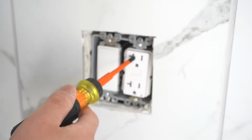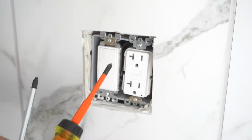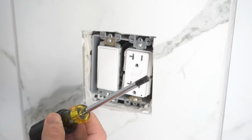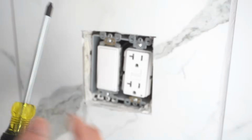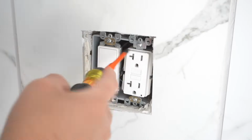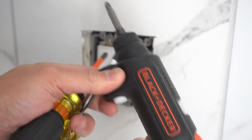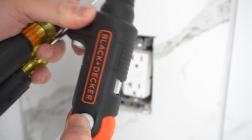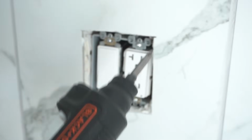There's 3 ways you can unscrew these outlets. You can use your typical flathead screwdriver, which most people use, but I highly suggest that you use a combination head screwdriver like this one. This is actually made so that it fits directly onto those screws without having it threading out. If you use the flathead, there's a tendency that it will start threading out these screws. And the third option, which I like using, is this Black & Decker, and it's a cordless one. It's rechargeable like so, and you can change the positioning of the handle just by pressing the button like this. If you're interested in any of these 3 tools, I'll leave the link in the description.